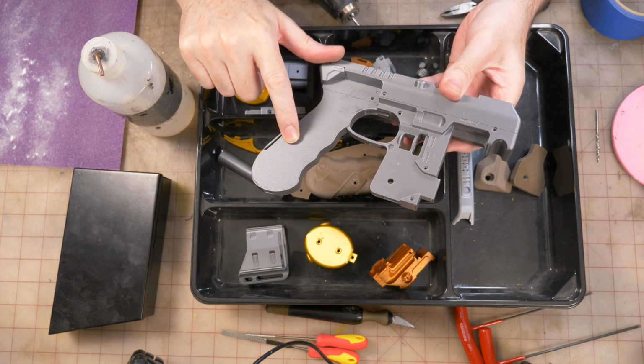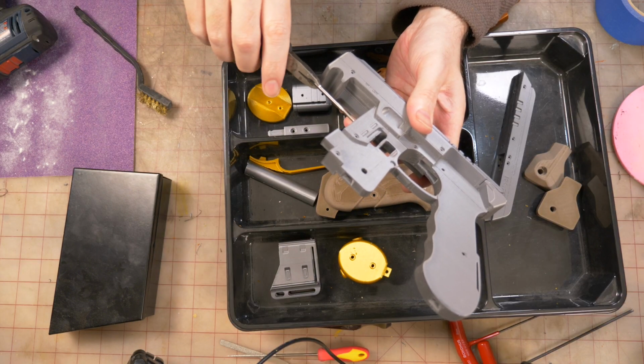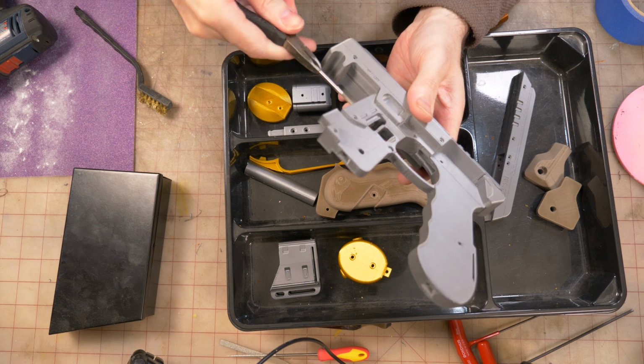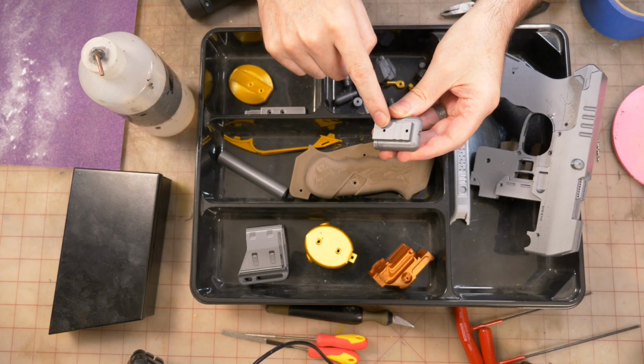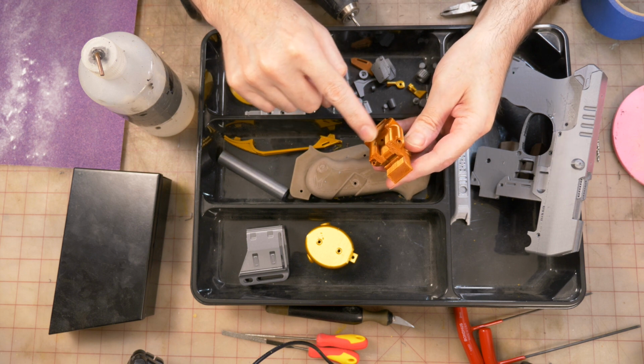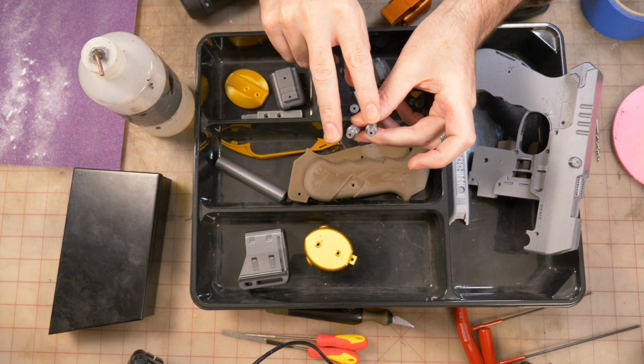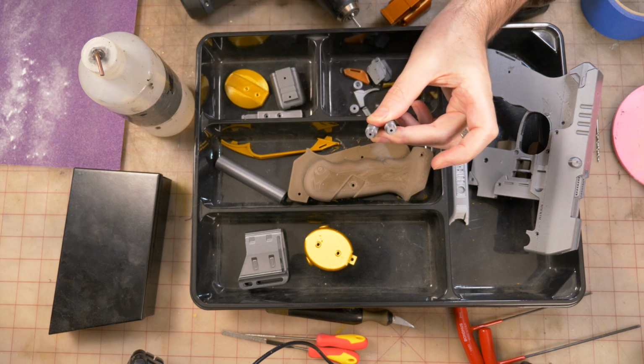That's these two for the grips. There's two here. This one you might need to screw in by hand because it's hard to get a drill in there. These two need to be tapped as an M3. This hole is an M3. This one, and this one are M3s. And then the two holes on the bottom of these tubes here also need to be tapped as an M3.